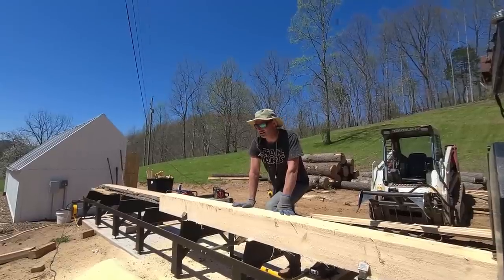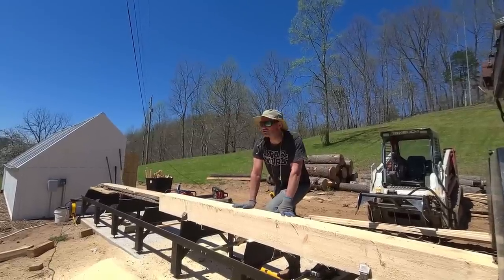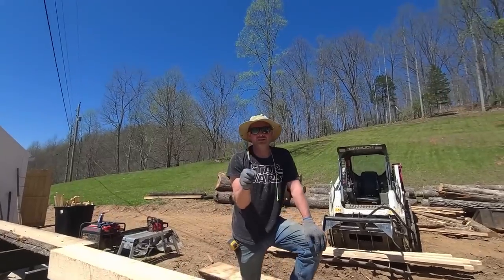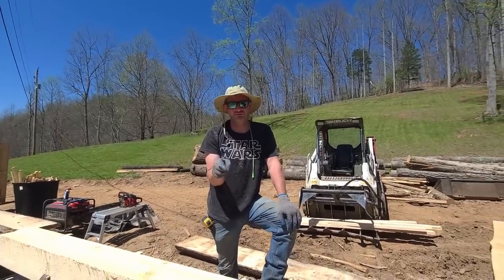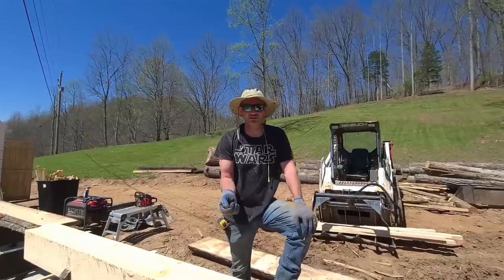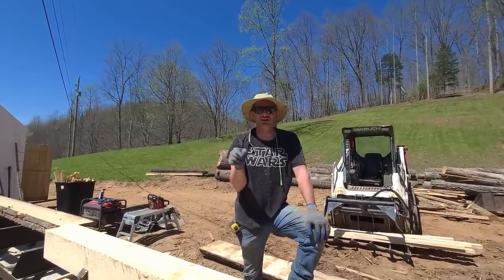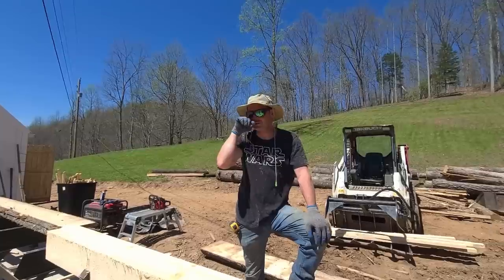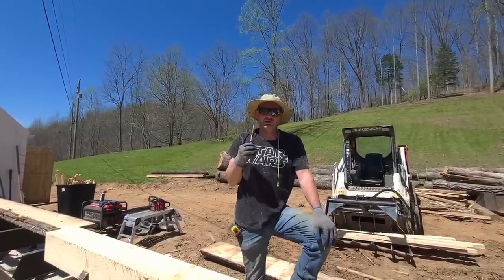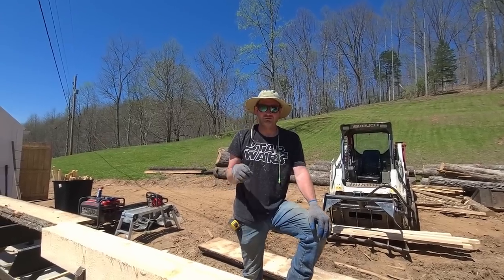So what I did, a lot of people call it debouncing. Basically, if you push a button, tell the computer to start counting to 50. Now, we're talking microseconds here. There's a million microseconds in 1 second. In the computer world, you can't press a button that fast, like under 50 microseconds. You just can't do it as a human being. So I tell the computer, when you think a button's pressed, count to 50. And when you get to 50, check, is that button still pressed?